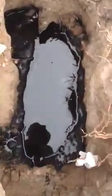Right there, this line goes across this home from that laundry way across and hooks into the main clean-out. See all that grease right there? We just blew through it with the jetter. Jetter only took minutes to open it. Now we've got to clean it up before we can move on to the main line.